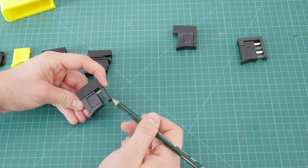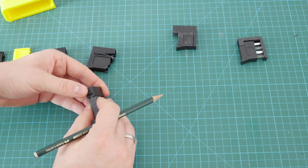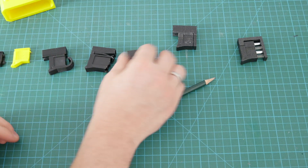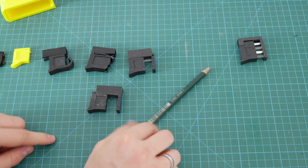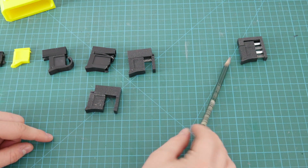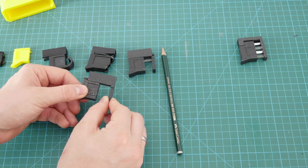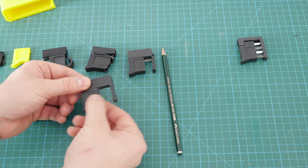Even with three springs, one of the sides will tilt, which hinders the smooth movement of the top part in the rail. There was also too much tolerance. Next up, I changed the design again — it's a two-part piece, but still the same issue. There's too much movement in the slot piece, and if I make it way smaller I cannot move the part at all.